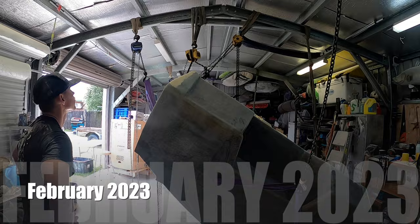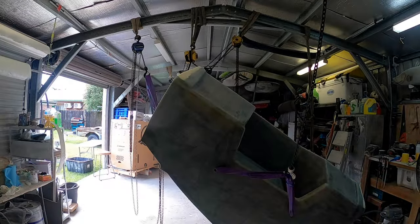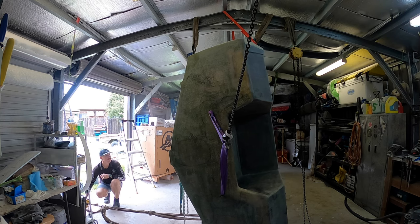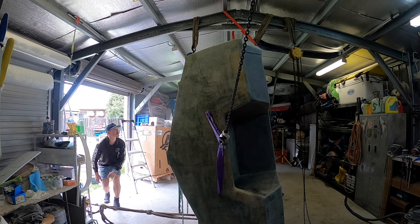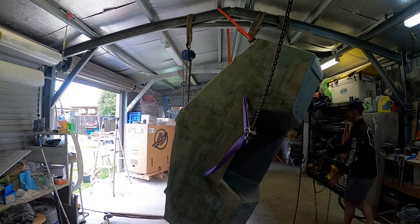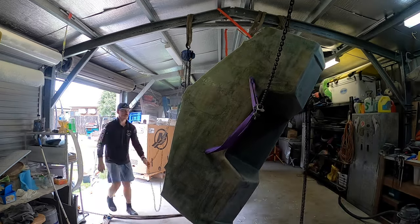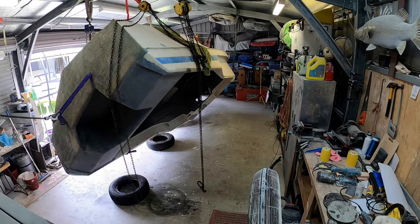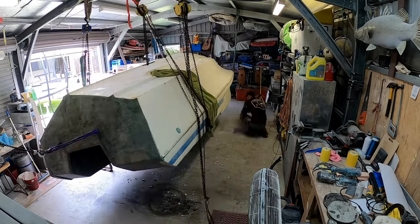So I made the choice to flip the boat over. The shed is reasonably new — only about 10 to 15 years old, cyclone rated for up this way so maybe a little bit stronger than your average shed. I did a few little test lifts and decided to flip the boat basically off the shed. How I attacked it was I supported the back of the boat through the holes in the rear of the transom, and supported using the eye on the bow of the boat. I basically lifted the boat up off the ground, then used a series of chain blocks and come-alongs and just spun the boat in the air. A few things that can catch you out are the length of your chain blocks or come-alongs and height clearance — that did catch me out a couple of times. But apart from that it went pretty smoothly. It took maybe two and a half to three hours all up, and when I flipped it back the other way it was a hell of a lot quicker.